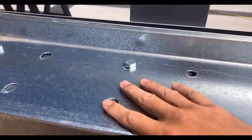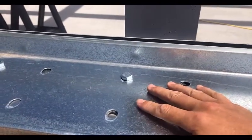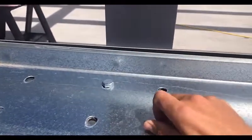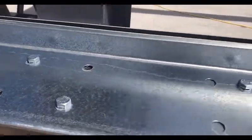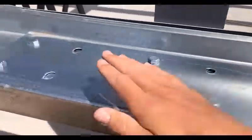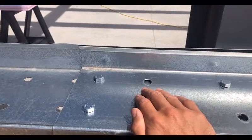We could easily put four bolts in, but it's not necessary and we don't want to run out of bolts. Diagonal — we leave these loose until the building is completely plumb, and then at the end of the laps, two bolts at each lap. It should be pretty obvious which holes to put them in.